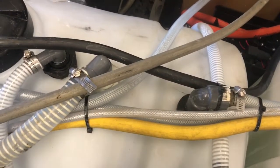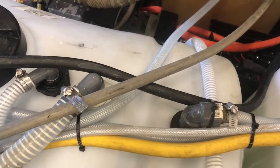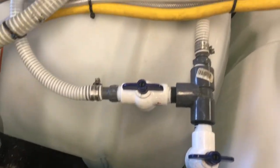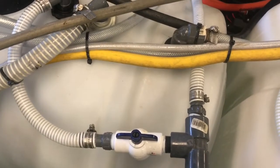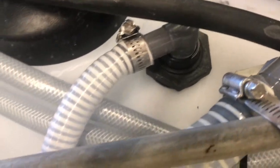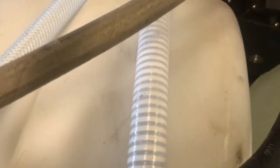I'm going to see if I can spray it here to see if we can get some air bubbles going. Right now I've got it on water because I am actually rinsing it out. I checked my pressure hose and it is working, but my water is not — I say it is that fitting right there, that bulkhead fitting. But if you look in this hose, this is why we use clear hose: you can see the air bubbles going through, and you can see them in here. It is kind of hard but you can definitely see air bubbles.